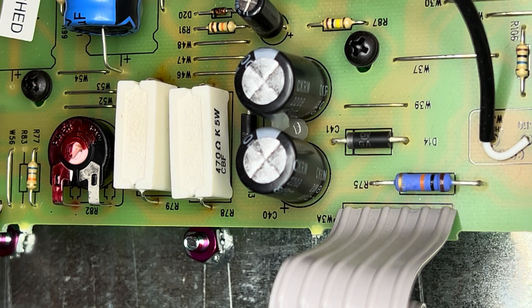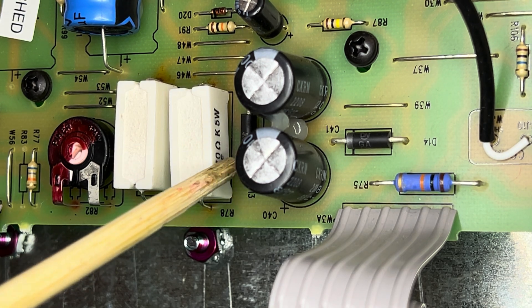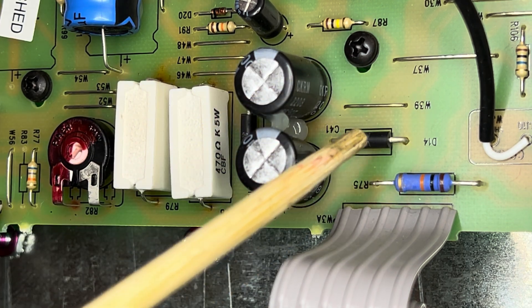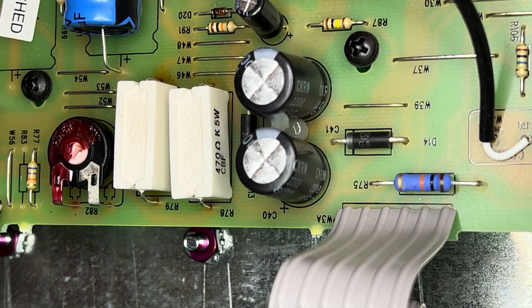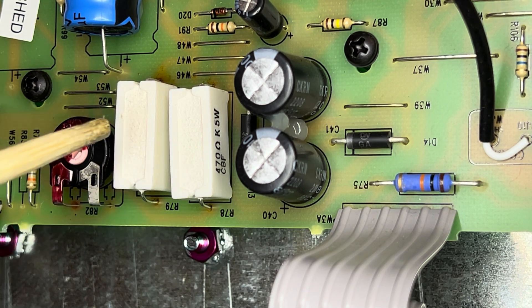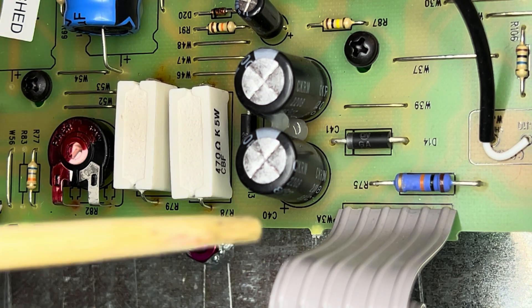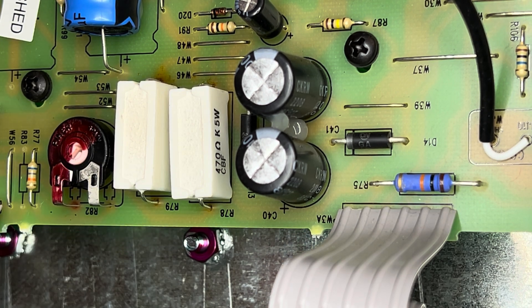While I have this board out, the next things to cause damage will certainly be these diodes here — they're not going anywhere good. So I'll replace these with the appropriate ones, except I will put an air gap there. It's not the air gap itself that does the job — it's the extra lead length that actually dissipates the heat. So it's not the body of the component; it's the heat sinking created by the additional lead length. You could actually poke the leads all the way through and coil them up nice and flat to create little heat sinks — but I wouldn't recommend that because they could move and short things out.